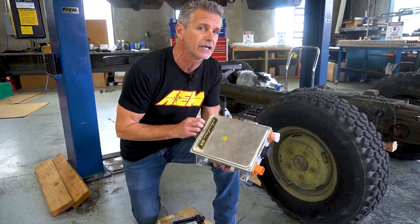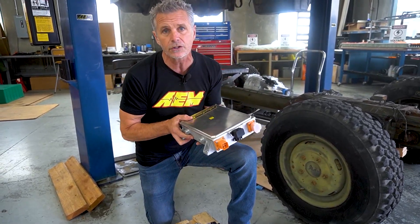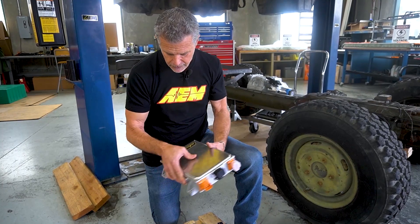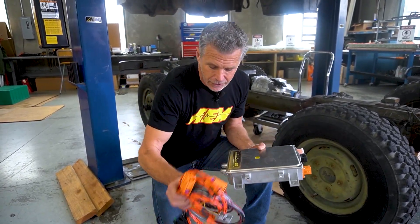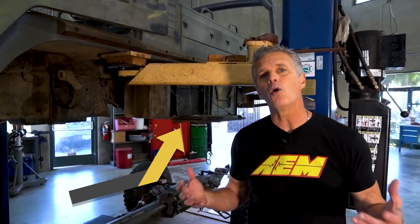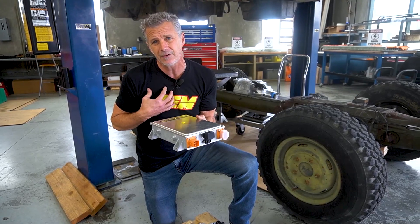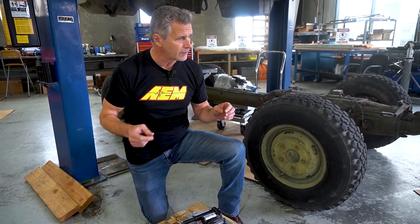So we have a 12-volt circuit — I'll expand on that in a bit. This is also an onboard battery charger, so it charges the pack. Really nice little piece, liquid cooled. We've got a starter harness here for everything, and this is going to be mounted in one of the belly containers we keep referring to. With this build I really want to focus on the EV part, but this is a complete conversion and we're doing a lot of other little things we hope make a big difference in the way the vehicle performs and looks.